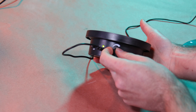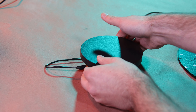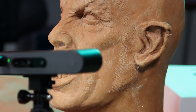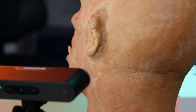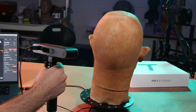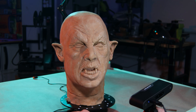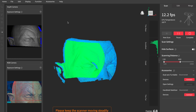It's hard to adjust the dial once the top is on, so it may take some experimenting to figure out what speed works best. I was originally going to scan the mask on the turntable, but I had a hard time getting a full scan without the tracking getting offset. It's probably because the back of the head is really smooth and doesn't have a lot of surface detail for the scanner to latch onto, so the scan tends to get lost and shift in the back. What I ended up doing was just manually turning it as needed — I still find it easier to stay in one place and have the object move instead of walking all the way around.